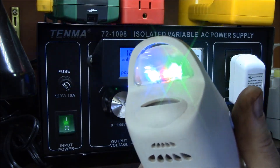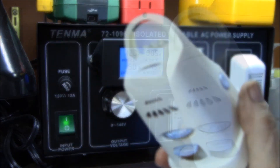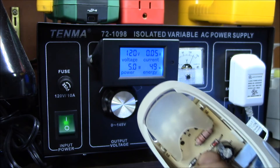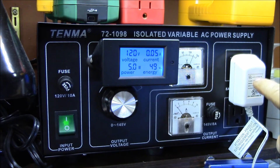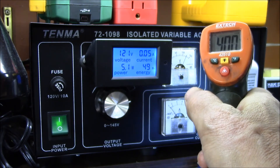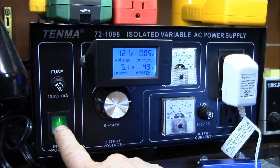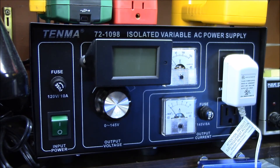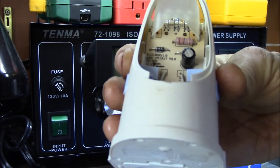These little wall transformers are not terribly efficient. You've got 90 milliwatts of light taking five watts of power. So if you're using one of these as a nightlight, you might want to at least cut that resistor loose — that resistor is burning three watts. And even if you did that, you'd still be burning about two and a quarter watts just to keep this transformer running. The wall transformer is running at about 40 degrees C, so there's some heat coming out. The best thing you can do is unplug it — then it uses zero power. But there's no way to turn this off with the switches on the device; it is an always-on device.